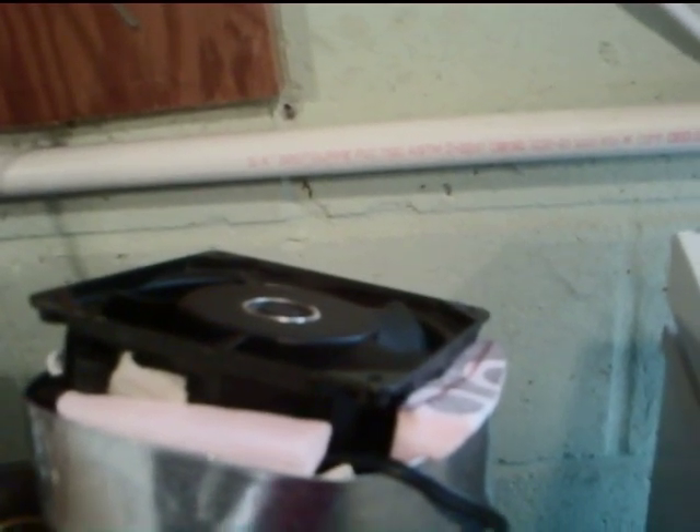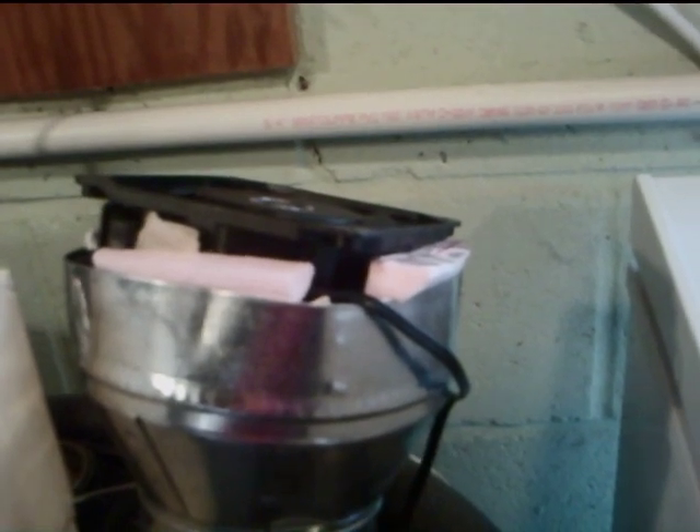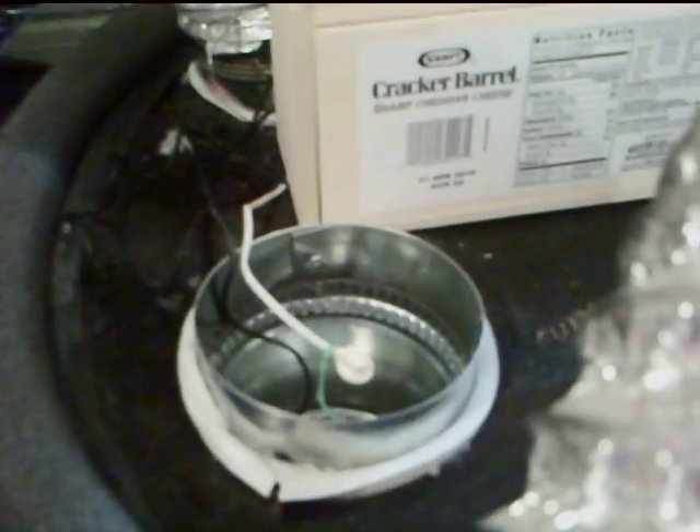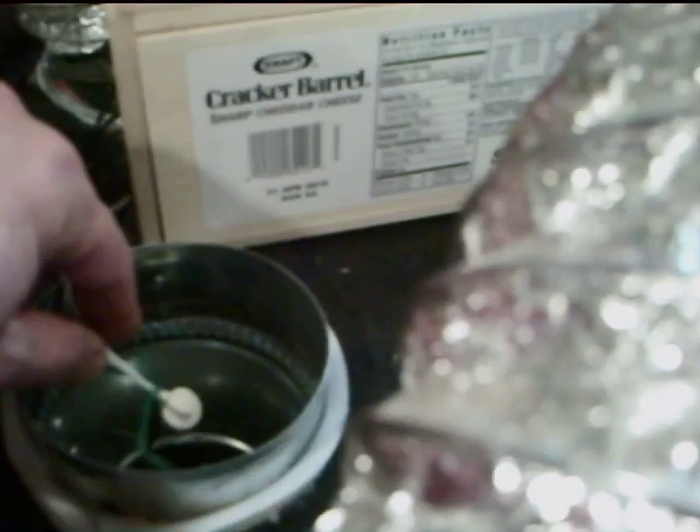The duct work begins here — I've got a mainframe fan from an old mainframe that was no longer used, it's 50 to 75 CFM. It starts with a sensor set at 35 degrees Celsius, so when the drum hits 35°C it trips the fan, which turns on and starts blowing air from the basement through the 25 feet of coil tubing around the 13 two-liter bottles of water, and then the air comes back out into the room.